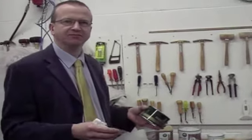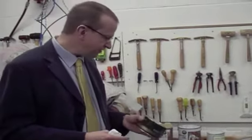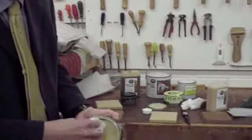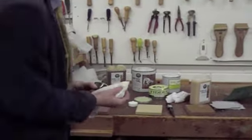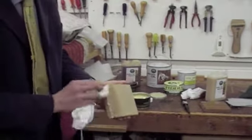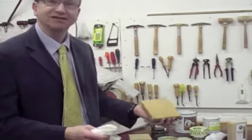It's not as durable in the long term. You might find once or twice a year you have to re-coat the wax to get a bit more protection and feed the wood. Very simple to use. Take the wax — just like polishing shoes, there's not a lot of difference really. Swill it around, apply it to the wood. Give it five minutes, buff it up to a sheen, then apply a second coat and that's it. Job done.